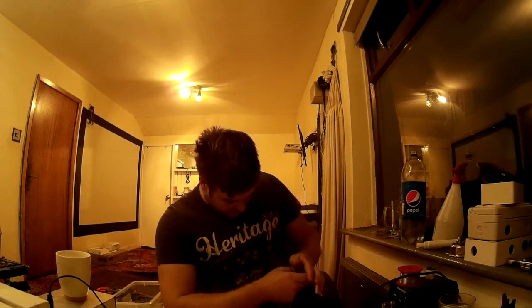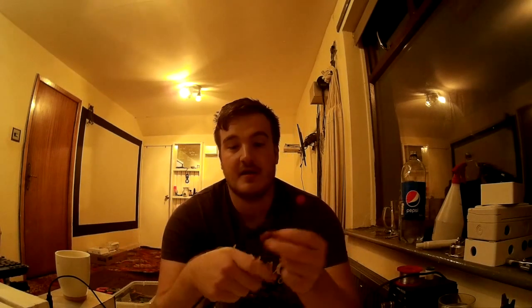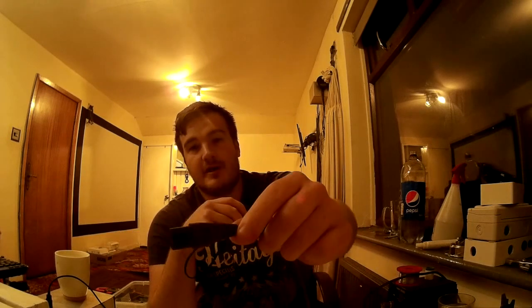But what I recommend doing, they're very cheap to buy on eBay. I've just ordered another one for £1 with one of these ends. So because these do wear out and I'll need to clean them and they're that cheap, I'm just going to swap them and throw them away. So to save having to solder onto a header each time, I'm going to solder this header onto the counterpart of this. So you just buy a plug extension, plug it into your case and unplug it and replace it whenever it does need replacing. So I recommend using this end and the female part on the Arduino.